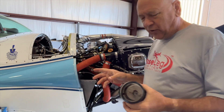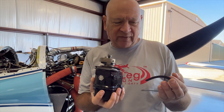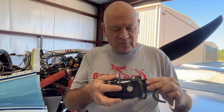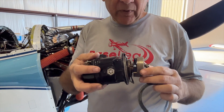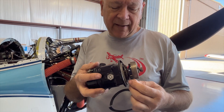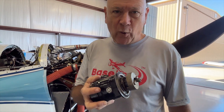We could show you, but everything's kind of cluttered back in there. Right underneath each magneto is the drip of oil, so now we've got to go back in and replace these gaskets. Again, when you loosen up the hold-down clamps, pull the mag out a little bit. Verify the gasket is loose. If it's been sitting there a long time, there's a very good chance you'll have to pull the mag out and replace the gasket, or you're going to end up with one leaking.